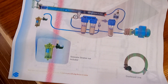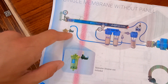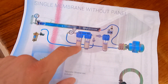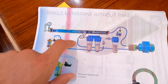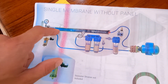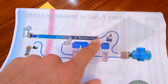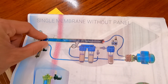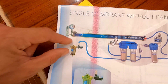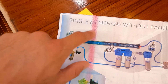Following this diagram from Seawater Pro, you can see how easy this system is. Raw water comes in from the ocean, goes through a sea strainer so it doesn't clog the boost pump. The boost pump, which is below the water line because it is not self-priming, then goes through a one-way valve into the two different pre-filters. You'll then confirm you're at the right PSI to feed into the main pump, which pressurizes the system to 700 PSI. The membrane does the actual work of separating salt water from fresh water — salt water passes over the outside, and any pressurized water that makes it through becomes your fresh water in the center. The product water and brine water are separated at the end: brine water goes overboard, and fresh water, once it's ready, is diverted from the T-valve into your tanks.